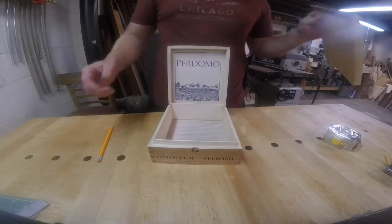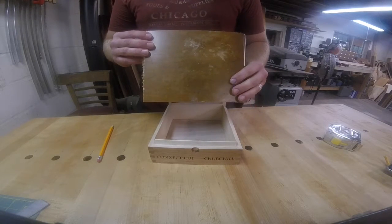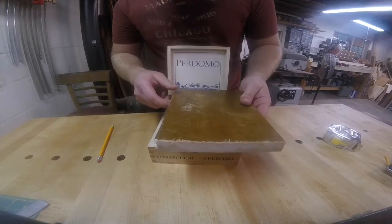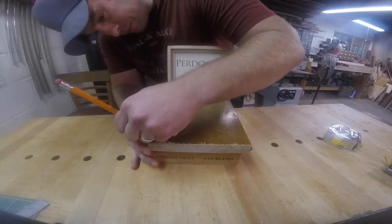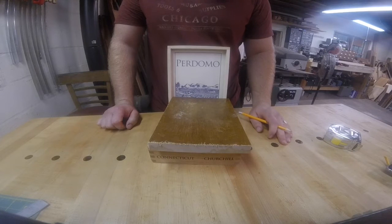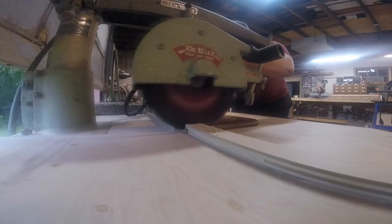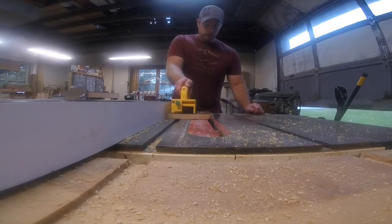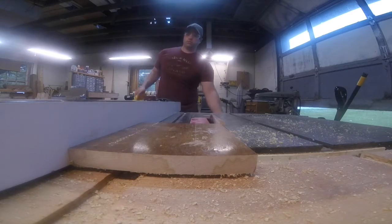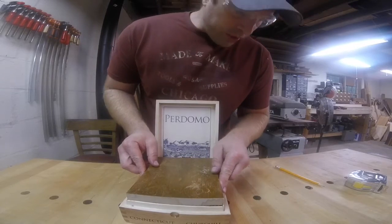The first major step is to find something to put inside your box. This is just a piece of scrap wood from an old tabletop. I've used MDF, I've used plywood, all kinds of different things. The next step is to make it fit in the box. I usually don't measure — I just take the piece and mark with a pencil where I want the cuts to be, then take it over to the table saw and sometimes the radial arm saw to cut it to size. Now we're back from the saws and we want to make sure our piece fits inside before we cut the grooves.